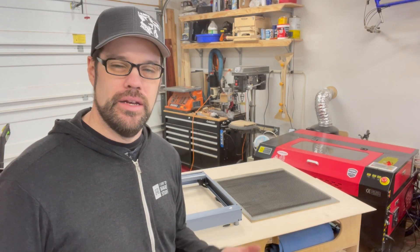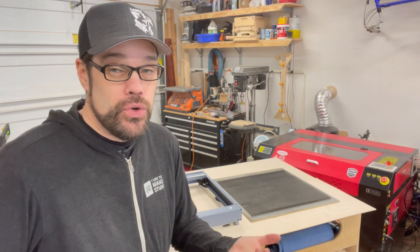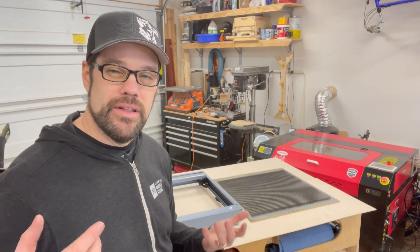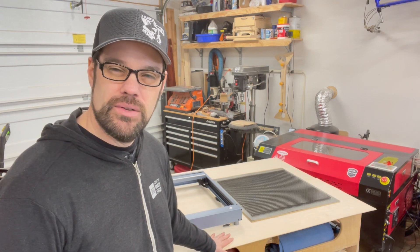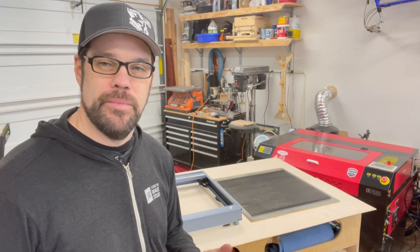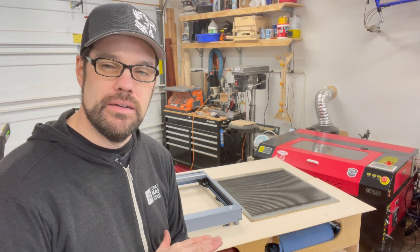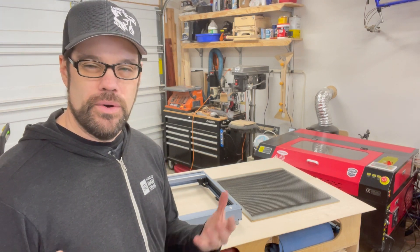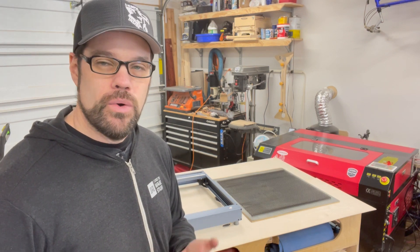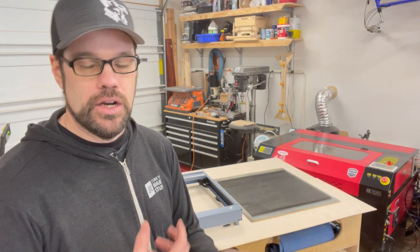Before we just jump in and start cutting and engraving material, we do need to make sure we're protecting the surface we're cutting on. This is not a device you want to just set out on the dining room table and go to town — you're going to run the risk of the laser ruining your tabletop. At bare minimum you want to put some sort of sacrificial material down. But I like to take it a step further and make sure we're truly protecting the material, giving the laser a really smooth, flat surface to sit on, and also making sure there's always a ventilation layer underneath the cutting or engraving area. It allows smoke or beam to cut through fully, rather than getting trapped between layers which can cause staining and create extra work or almost ruin the piece you're working on.